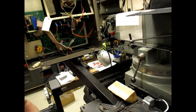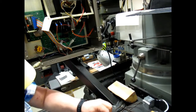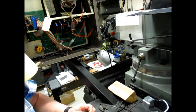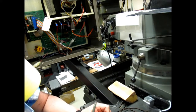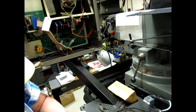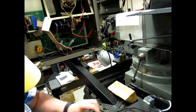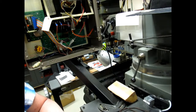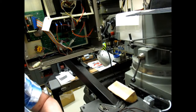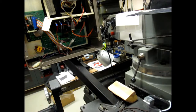Well, a dry stick, a 10 meg resistor, a sheet metal screw and a test lead will make up for the fact that I just can't find the high voltage tester that I used when I fixed televisions regularly. Incidentally, sticking your fingers into a box where a cathode ray tube exists is something that really ought to be managed by someone who has fixed an occasional television.